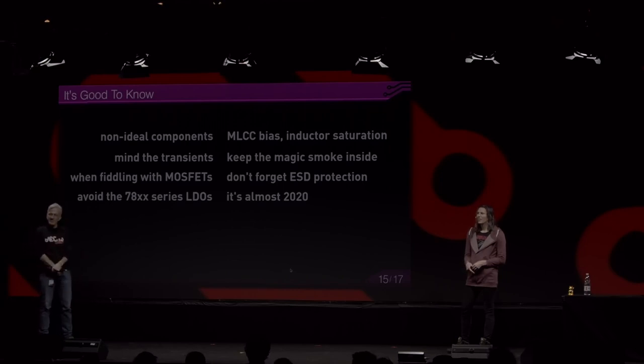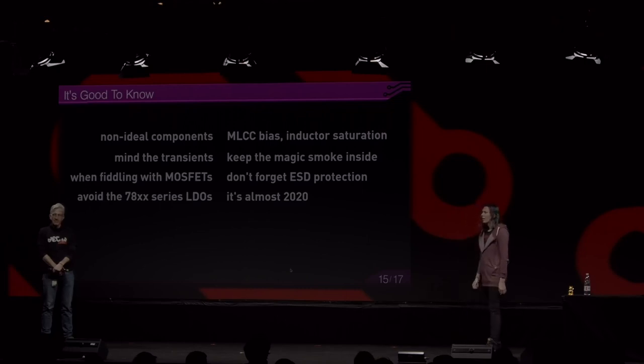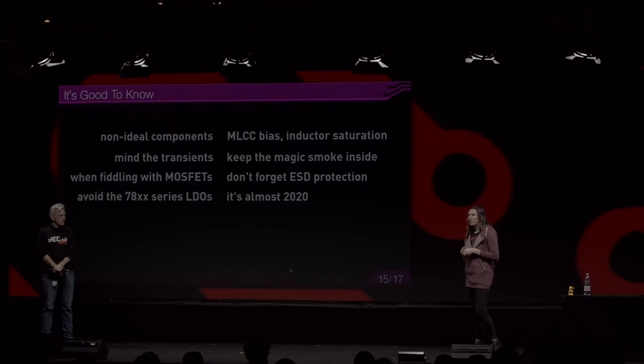Go ahead. Thank you very much. My question is, you mentioned the noise coupled via the inductor to the output. Which sort of filter do you recommend? Differential noise or common mode noise and input or output, which is most important from your perspective? So lots of the noise goes actually back to the input supply. And I said that in ideal circuit, the input capacitor is not necessary. But in a real circuit, the input capacitor is critical because the input inductance is seen by the switch.